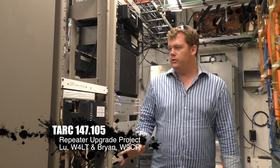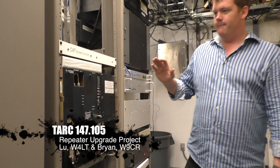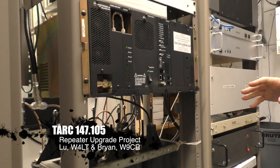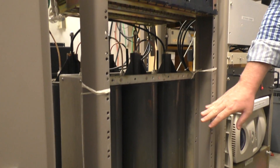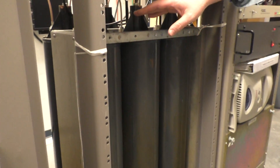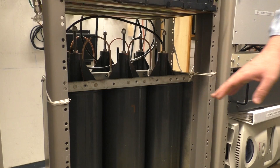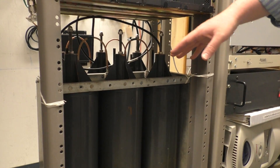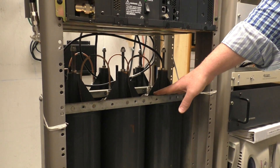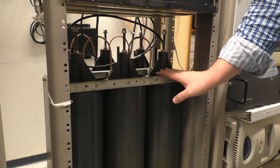This is the new TARC Tampa Amateur Radio Club Repeater. We've removed everything you can see from the rack here. At the bottom of the rack, or close to the bottom, these are duplexers. These are 1974 vintage Phelps Dodge that I reworked. They have just under a dB of loss with three cavities, which is pretty darn good. We're putting about 125 watts in or so and getting 100 watts out to the antenna.